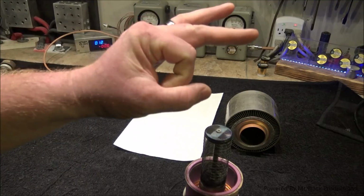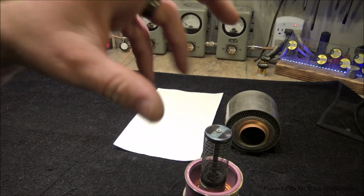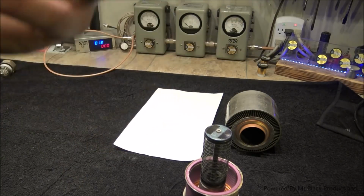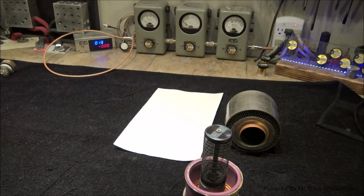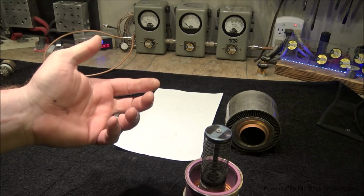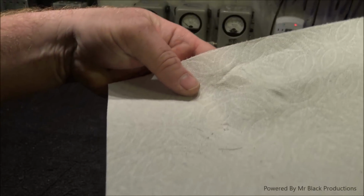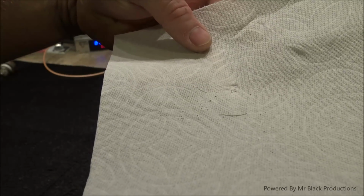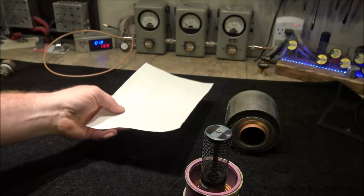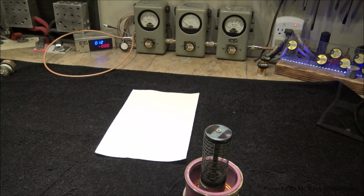They'll have a coil that they'll heat up with induction, which is a coil they put outside the tube. They pass a field of energy through the tube, and they'll heat up that coil through induction. It'll get super hot, and it'll burn off all the oxygen molecules and stuff. These don't have getters on the inside of them, so they use the filament to do the same process. But when the tube reaches the end of its life, you start having little bits of shmoo migration, just like this. And that little tiny wire is all it takes. Now imagine the distance. It's all it takes for you to have a completely catastrophic problem in your power supply.